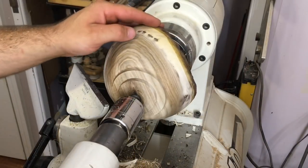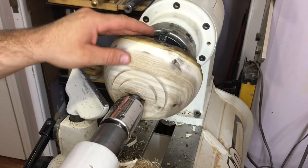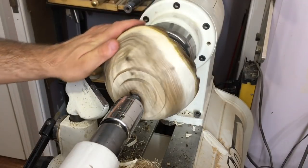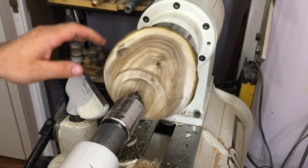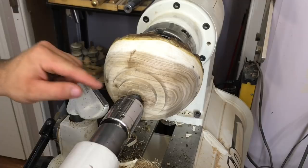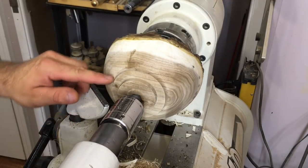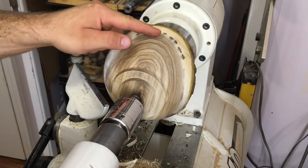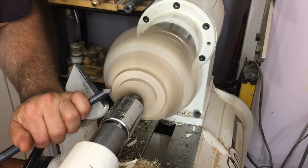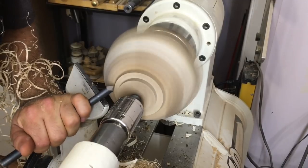I'll be honest — I wasn't actually planning on making as steep a walled bowl as this, but I've been rushing through it and after that phone call I didn't quite have the same rhythm. It's actually looking okay this way. The only thing is the diameter of the rim is a little bit smaller than I anticipated, so this foot is actually a little too big. I'm going to reduce the foot a little bit and ease that curve into the rest of the shape, and then we can move on to shear scraping.